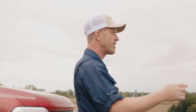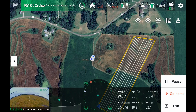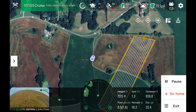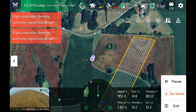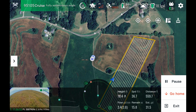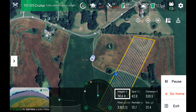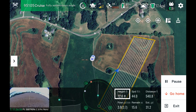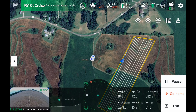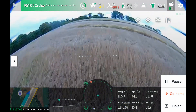This is a pretty short run field with a lot of slope to it, so there are some challenges here. Running a big drone on small fields has not usually been a great idea, but the J150 does seem to be changing a lot of that, especially with the terrain following. You can see it's maintaining a minimum height of about 10 feet — we can watch our height on the bottom right corner of the screen. Maximum height gets up to about 18 feet as it goes down the hill, and it's maintaining that speed of 45 feet per second going down and back up.